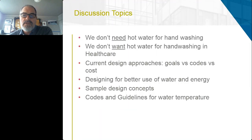And I've seen a lot of what Troy was talking about, issues with the pipes cooling off and then wait times for hot water. What we've been seeing is that, in general, the systems have gotten lower and lower flows, and dead leg pipes to hand wash fixtures have cooled, and people are generally completing their hand washing with water that has basically reached the ambient temperature of the building.